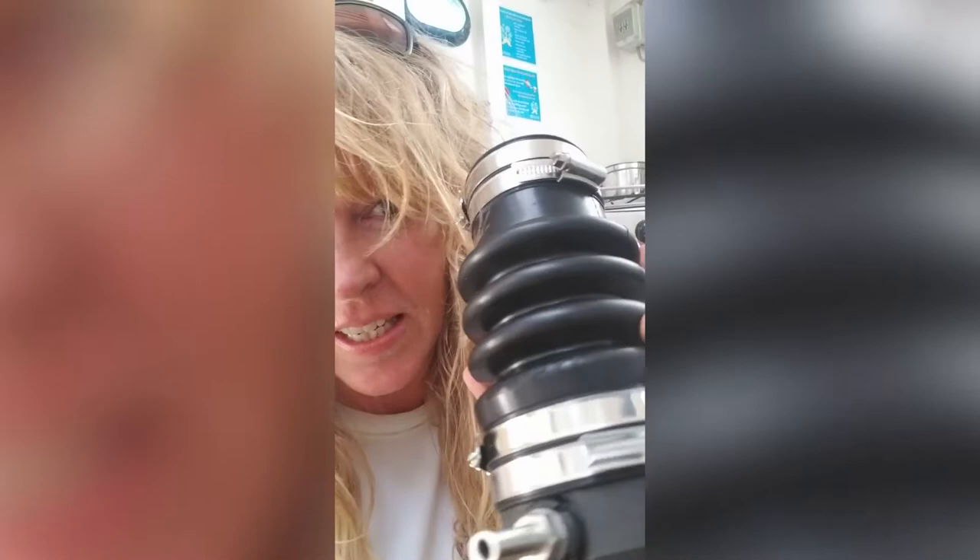We are switching out the seal on the drive shaft and this time I'm replacing it with a mechanical seal instead of a packing seal. Apparently it's going to be better, stronger, faster, greater durability. It still has this little fitting which is going to allow water in to cool it. It's more for industrial purposes — it's good for sailboats but it's particularly overkill as well. This should last a good long time — really a critical component.